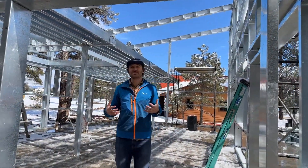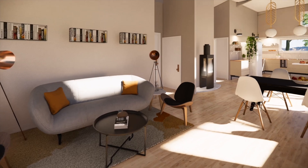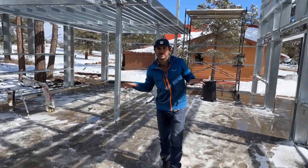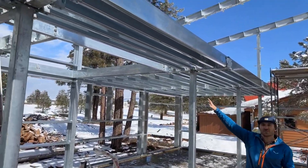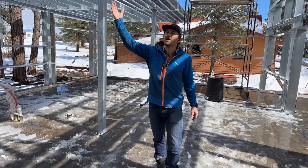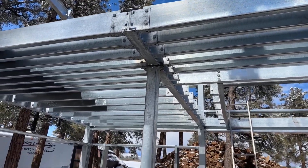I just stepped into the west wall of the Vesta — this could be a front door. We don't finish the interior so each client can dictate interior layout as they see fit. We're in the main living portion of the house right now. This is the Vesta Plus — there's a lofted second story. The main level living footprint is 24 feet north to south; the lofted area is 14 feet, so it cantilevers two feet beyond the center line of the house.